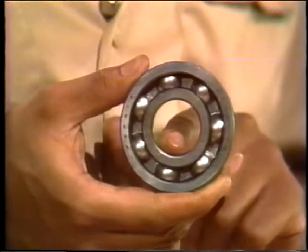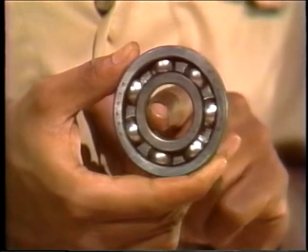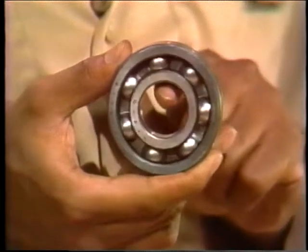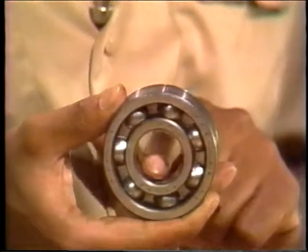After it's dry, inspect the bearing for signs of failure. Then turn it slowly while examining the races and rolling elements. Watch out for stiffness or binding as the balls or rollers turn. When you figure out why the bearing failed, throw it out so someone else won't come along and use it by mistake.